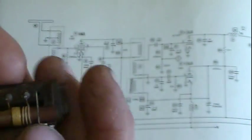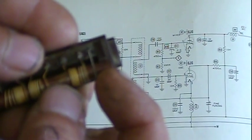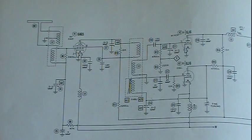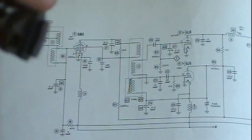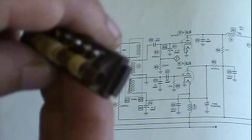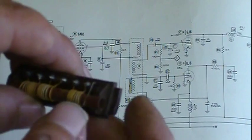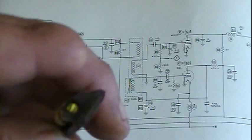In a case like that, what you want to do is lift this spring up gently and off to the side a little bit so it's not interfering. And you may have to tap it a few times to get that to drop down. If everything's all right, this form has not been even the slightest bit damaged. If it hasn't been damaged, it will drop down plenty far enough that you can re-engage the spring and you're good to go.